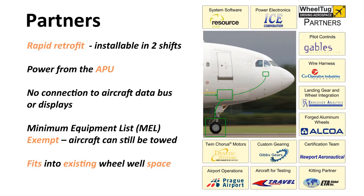In addition to being a rapid retrofit product applicable to existing fleets of narrowbody aircraft and operating from the APU, it's important to point out that the airplane will not be talking to the Wheel Tug system in any meaningful sense — the only interaction is with the pilot themselves. The system is MEL exempt, which means that if the Wheel Tug is not operational for whatever reason, the airplane can be moved with a pushback tug and with the engines as it does today. Very importantly for a retrofit perspective, the modifications to the airplane are quite minor and essentially involve the wire harness and putting the inverter and cockpit panel in. There are no changes to the wheel well space.